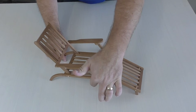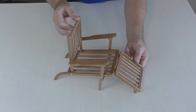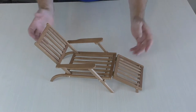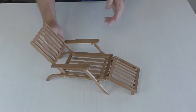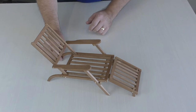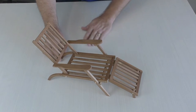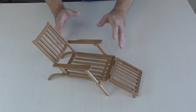Using the models, I figured out that if the distance between the pivot points remains the same throughout the pivot, the folding works without any sliding mechanism — it's like a loosely nailed box that flops on its side without coming apart. Once I figured that out, the rest of the design became easy, all thanks to the scale models. Don't pass up this opportunity if you're unsure how joints will work or how pieces will move — a scale model is often a really good idea.